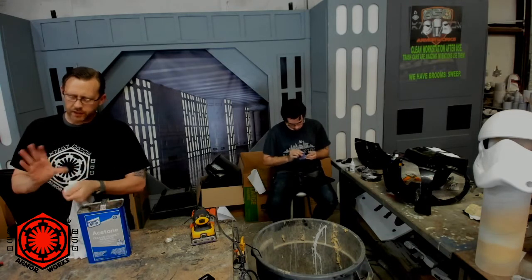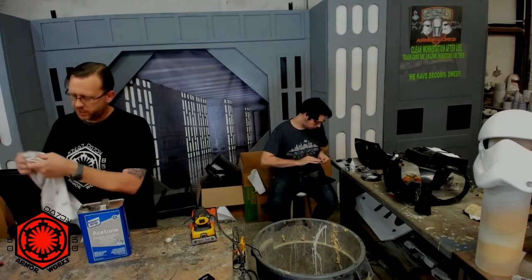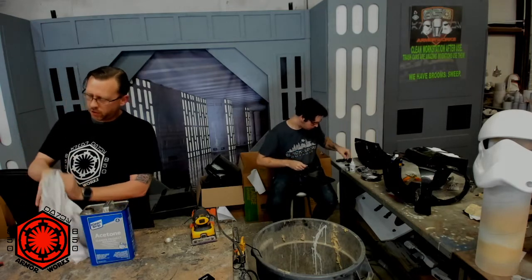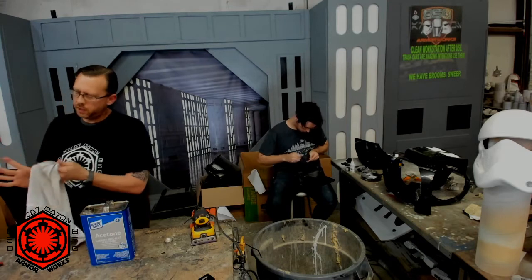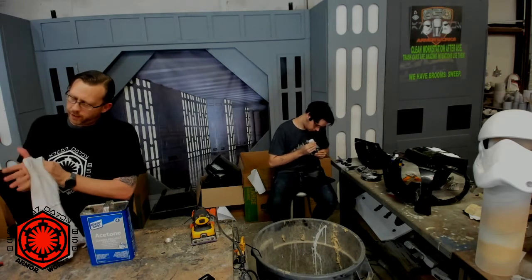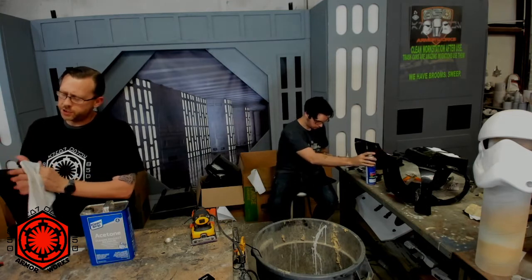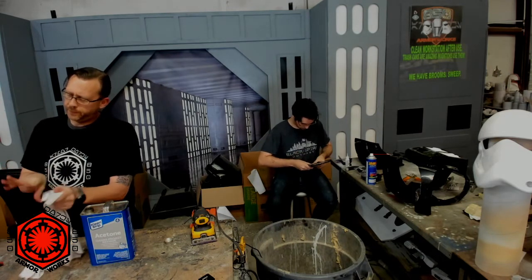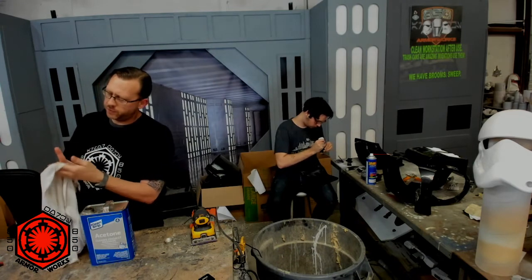We got the fans. We're probably going to have to go rent a welder and get some strap or angle iron. And we got to weld the door closed because of a bad seal, and we have to cut away the retention bars that actually hold the door just so we can install the air-in fan. So, you know, doing it really cautiously and well. And right after we get that done, we'll be doing a little bit of foam insulation because it's in the hottest corner of our building. It's the southwest side, so it stays really hot over there. So a little insulation on the top and on the outside will go a long way. And then we're going to run the electricity and sheetrock and air hoses. It's going to be fun. A lot of work ahead of us, but it'd be very nice to have that booth right there, because we're going to be painting red here very, very soon, as soon as we finish up with the Sith Trooper.